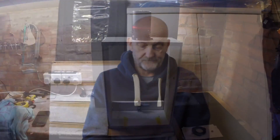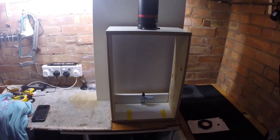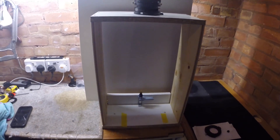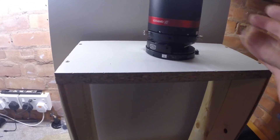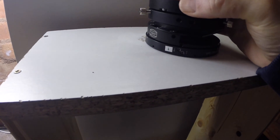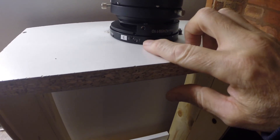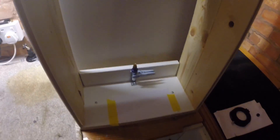So let's get to it — I'll show you the laser jig I built. It isn't pretty to look at but it does the job. As you can see, it's just four pieces of wood screwed together. There's no ideal height or width — these are just four pieces of wood I had lying around. Then you need a 50mm hole on the top and two blocks so that when you put the camera on, you can rotate the camera 360 degrees in the same spot. I leave my filter drawer and tilt adjuster in place, so this is my full imaging train screwed onto the field flattener.